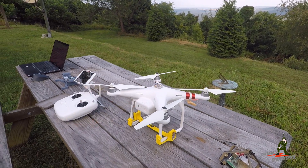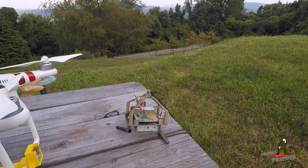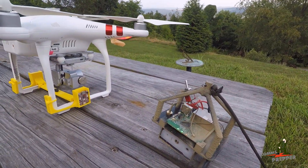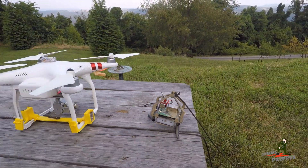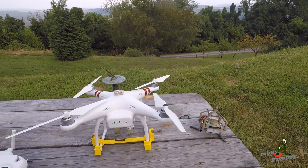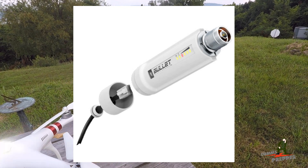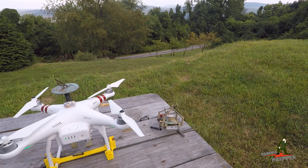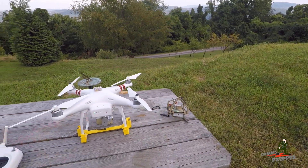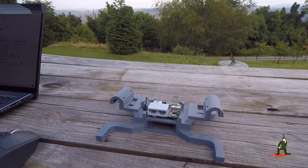We completed a safe flight with the drone and landed the Phantom 3 Standard. What I did is I took the circuit board out of the commercial housing to reduce the weight, then 3D printed that cradle, and I'm running it with three AA batteries with a little toggle switch on the top to turn it on and off. There was a big improvement in the link quality providing that vertical separation, but I think it either needs more separation or I might need a more suitable device — maybe a Ubiquity Bullet radio, which is a long cylinder. I can take it out of the housing to reduce the weight; it still has a small footprint and you could still get it up with the drone. The more payload you have, the less flight time you have, so that's a trade-off.